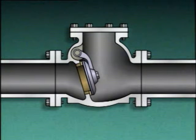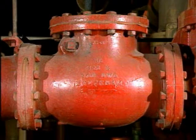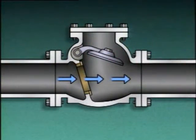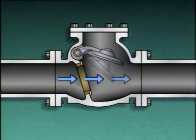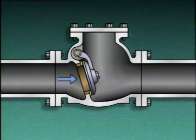In some cases, the arm that holds the disc is weighted to assist in closing the valve. In other cases, a spring may be used to help close the valve. It's also common to find the direction of flow indicated on the outside of a check valve's body — usually an arrow is cast into the valve body to ensure the valve is installed with flow in the proper direction. If flow is intermittent, the disc may repeatedly rise and fall, slamming against the seat, which can damage the disc and seat and result in leakage. This condition can often be detected because noise and vibration are produced in the piping.